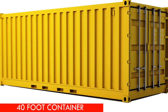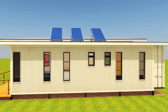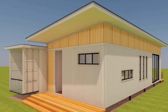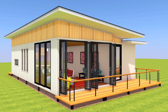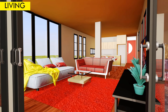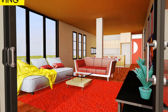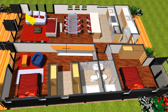On structure and modifications, we have very minimal modifications on the exterior of the shipping containers. The size of windows and doors used are fairly standard and minimal in size, save for the full-height sliding glass door provided onto the lounge space — that particular area will require a bit of additional steel reinforcement. In addition, we'll also need to do structural modifications to the open plan living room because we've cut out all the internal walls to create an open plan. On the bedroom quarters, very minimal modifications will be required.